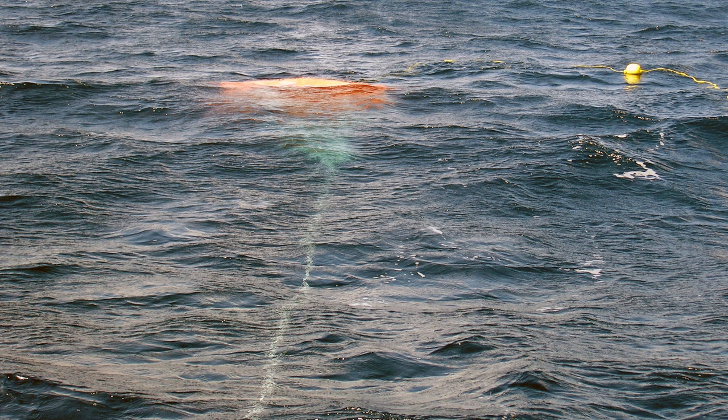I deployed it over the port bow — not in front of the boat's centerline, but off to the windward side. I just threw it out there. My concern was that the vessel was not going backwards fast enough for the chute to deploy and that it would just keep taking line out and be right there. But there was no concern to be had — I wasted my time worrying about that. You need that leeward drift. I'd throw it off to windward and expect it to feather out away from the vessel, which it actually does very well.